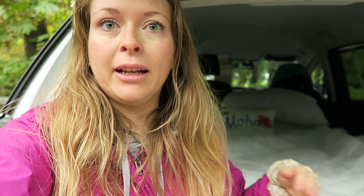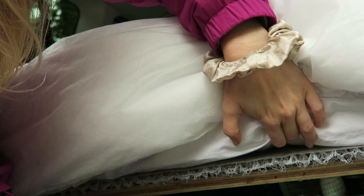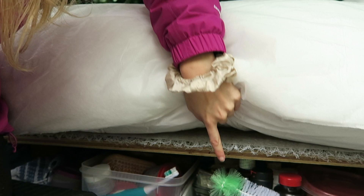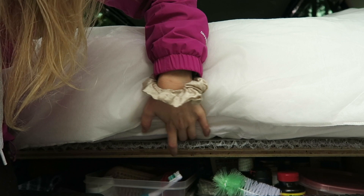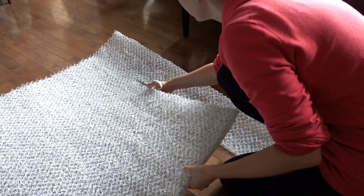When you normally have a bed it's got wooden slats for airflow — this is so the wood doesn't mold, because we sweat in our sleep, which wets the mattress. So you need airflow so the wood doesn't mold. What I decided to do was get this piece here that's made specifically for airflow — it's used in houseboats and some RVs. It sits between the mattress and the plywood to allow airflow so the wood doesn't mold. I cut it to fit the bed.